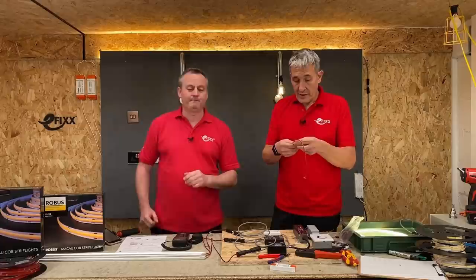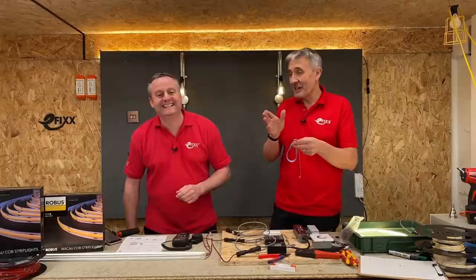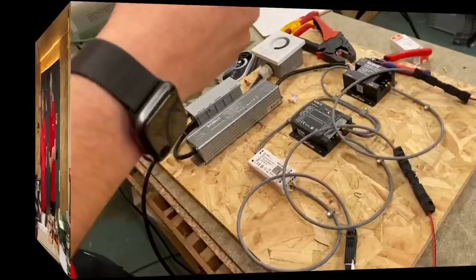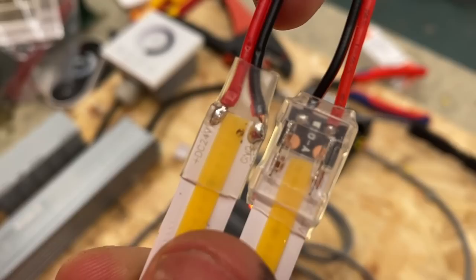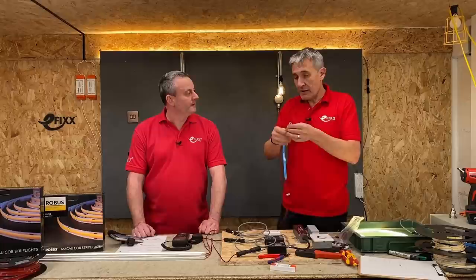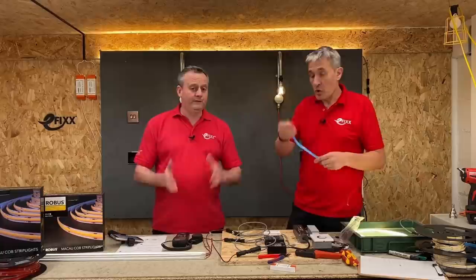Anyone who's seen me solder before — my days of soldering to LED strip are over! I can hear the cheering already. With those IDC connectors they're incredibly easy. This system would work equally as well on site. I've done two versions here — one soldered and one using the easy clip connector system — and it looks a lot more professional. It's also a lot more robust. If you can do an LED project off site and get it prepared before taking it to site, it makes life a lot easier, especially in those challenging circumstances like being in a very small space.